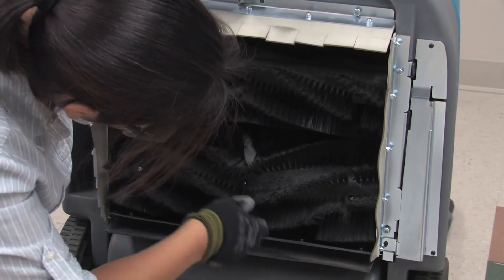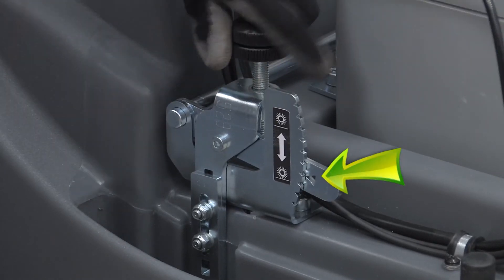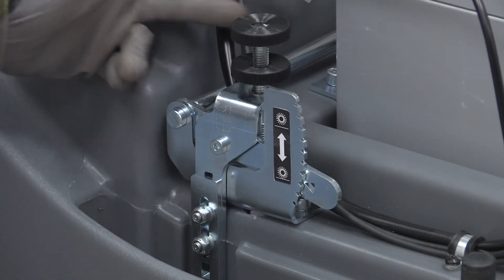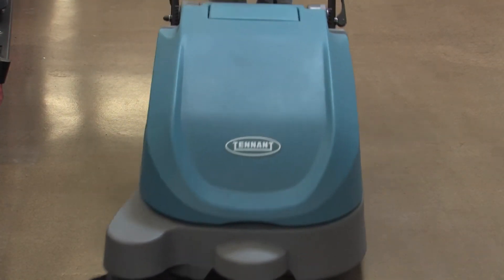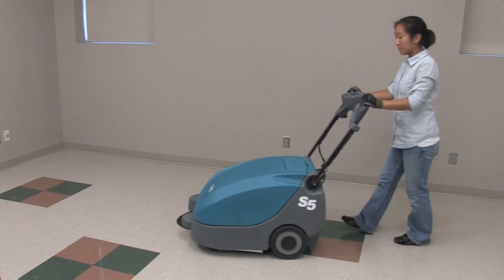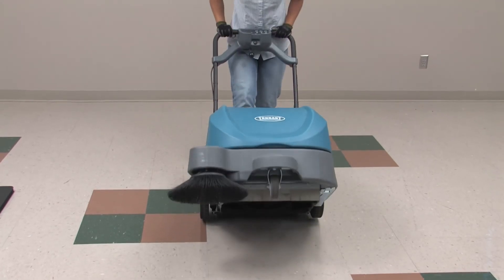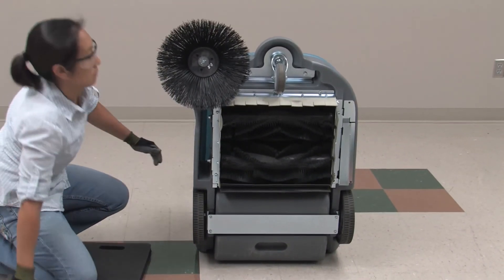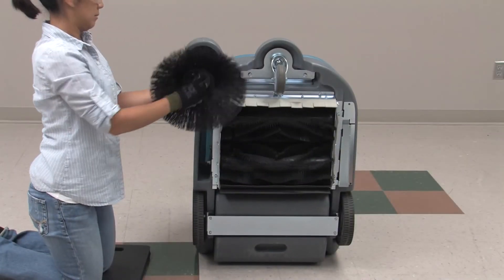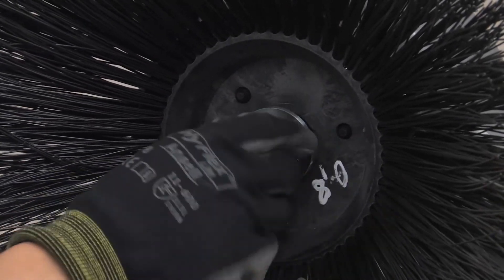Repeat the previous steps if replacement of the other main brush is required. Note: when a new rear brush is installed, the brush pressure adjustment mechanism should be set to the sixth or seventh brush adjustment notch from the top and secured with the lower thumb nut. Side Brush Information. The side brush provides a wider sweeping path and allows you to clean next to walls and racks. To change the side brush, first stop the machine and press the power switch to turn off the power and raise the side brush. To remove the side brush, use the handle to tip the machine on its back. Then unscrew the thumb screw in the center of the side brush and pull the brush downward. To install the side brush, rotate the brush to align it with the positioning pins on the brush drive hub, then install and secure the thumb screw.